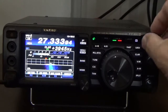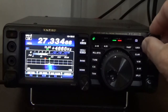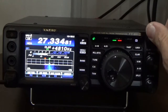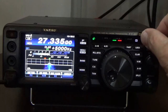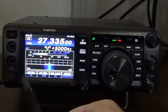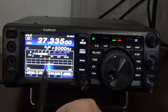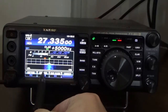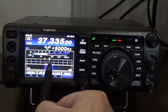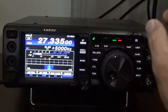It's going to be 5,000 Hertz, or 5 kilohertz. When I get to 5,000 I'm going to be on the resident frequency — and right there, we are. Notice our transmit frequency hasn't changed; the transmit frequency is still at 27.330. The receive clarifier has gone up 5 kilohertz, or 5,000 Hertz.